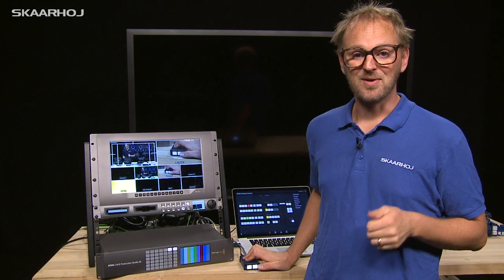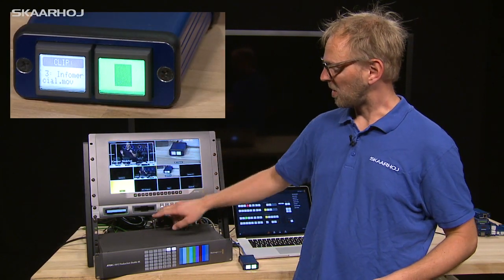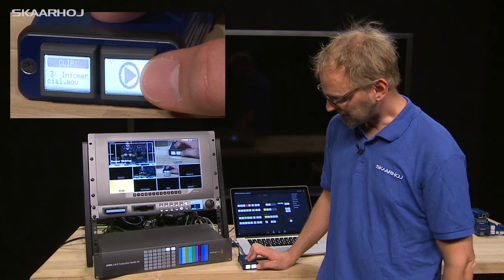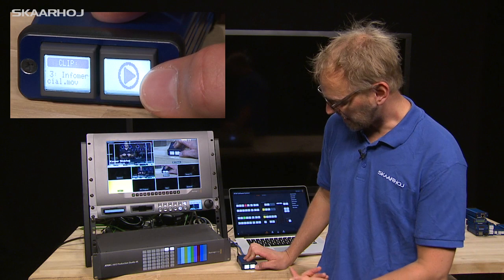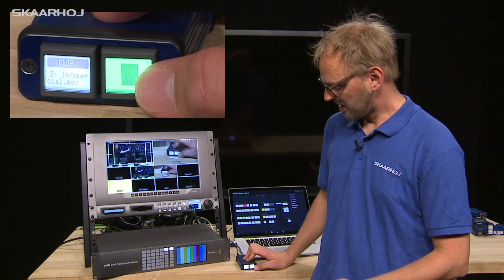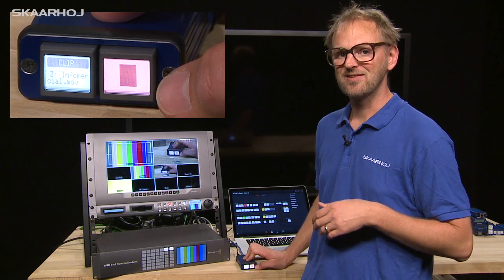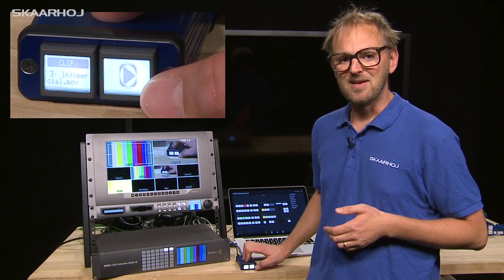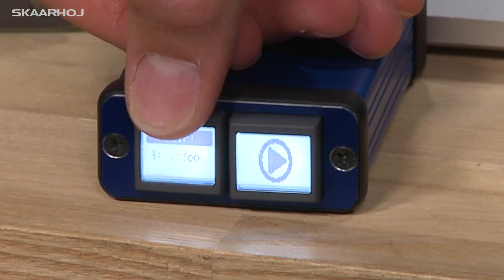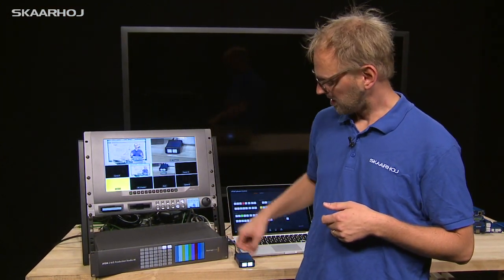This micro is also based on smart switches. When you press the button it will start playback of a HyperDeck, and when you press it again it will stop. The button shows a symbol indicating what's happening — a play or stop sign. If you press and hold, it will actually start recording, a hidden feature that gives you more flexibility. The left button selects which clip you are playing back, and the graphical button shows you the clip file name.